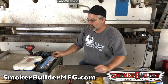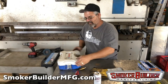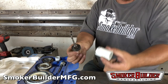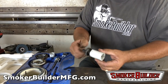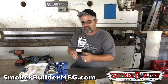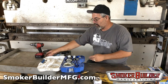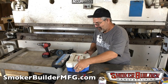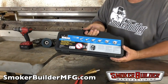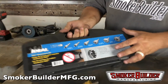You've got some big holes to drill. Most people have seen hole saws — you've got a mandrel and the saw, and you can go to the hardware store and buy just those two pieces in an economy version. We've also got a special set: electricians use this style of bit to drill breaker panels and various things. They're a hole saw — same concept.